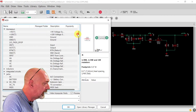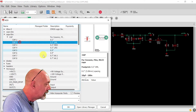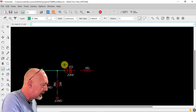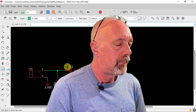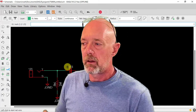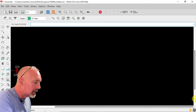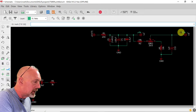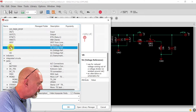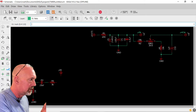I'm going to go a little bit quicker here and we'll get through this really quick, and then I'll provide you with a schematic at the end. Now this capacitor here — that's part of the charm of the tube screamer. It's going to cut some of the bass off; it'll make the guitar cut through better in a mix and in a live context as well. Now we have this power supply here — we have 4.5 volts coming off of this section and we're going to use that here. This VB voltage reference B, we're going to need it again right here, and what this is going to do is bias the first transistor that we go through.